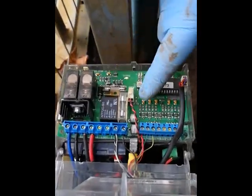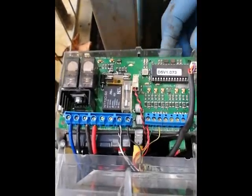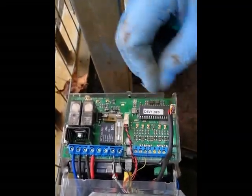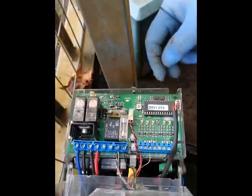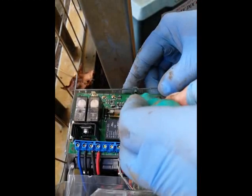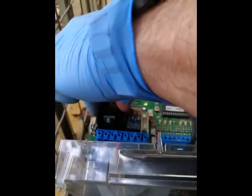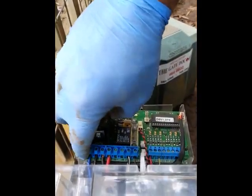Visually inspect the PC board. Make sure there are no obvious signs of ants making nests and causing corrosion, or water having got in. If you do find a bit of corrosion on the board, use a stiff little brush and brush most of it off if you can. The board can also be unclipped and the bottom cleaned if necessary. But don't put oils or spray Q20 or things like that onto the board.